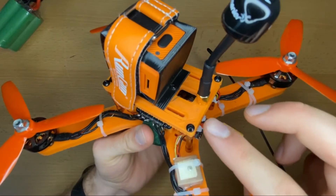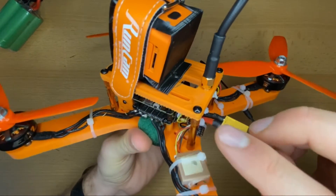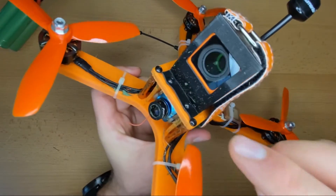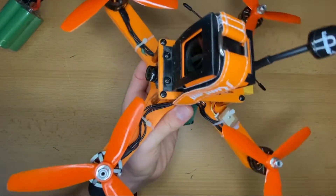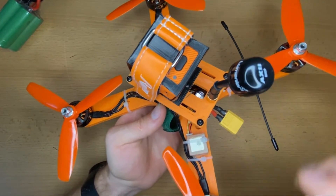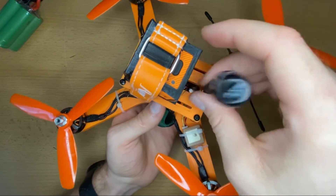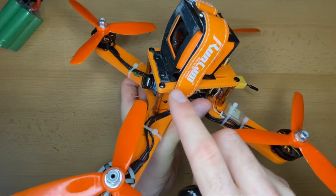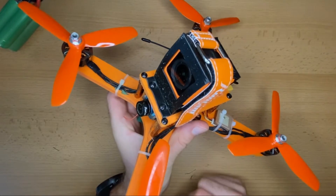On the top there is not too much to it. Only the holes on the edge have to be created to connect the top part to the standoffs and the bottom part. In addition, the holes for mounting the camera have to be placed here. I also put some additional cutouts in the middle and a small hole to connect the video transmitter. Here as well you can see I added another 3D printed part for connecting a camera on top for making nice videos.